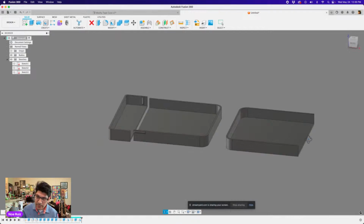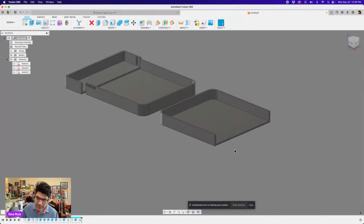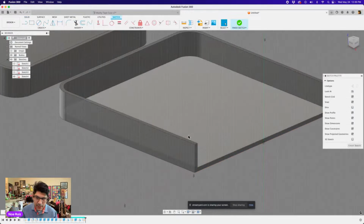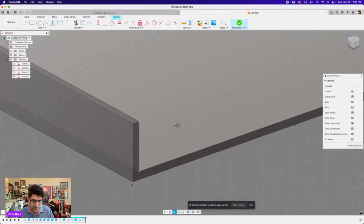But before that, before I forget, I want to add a lip to the top half of the case so that it mates with the bottom half of the case. And to do that, I'm just going to go here on this edge here, create a new sketch, and I will project in this line here from the internal wall. And I'm going to make a series of lines. So let's see if you can follow me.